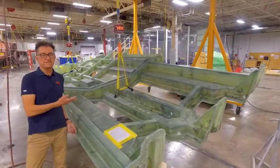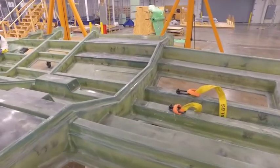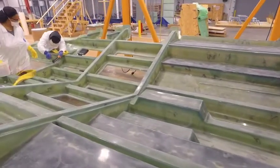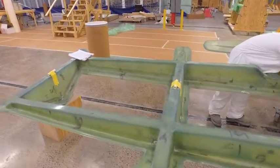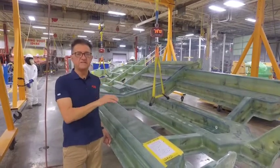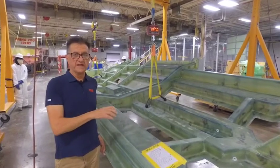So this is a good example of a complex geometry and a laminate that's making every gram pay for itself in terms of the strength of the boat. This was infused in one shot. Some insight into how fabrics work going around corners, into cavities, and then how do we wet this out in a very systematic fashion so we don't get any dry spots within the laminate.